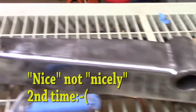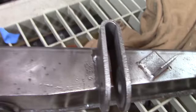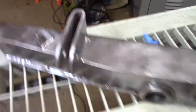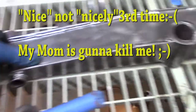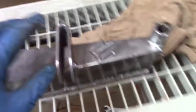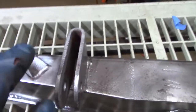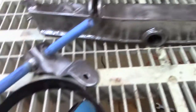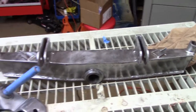That cleaned up rather nicely. I still have to figure out how to get down into some of the recesses here, but for the most part this cleaned up really, really nicely. So what I'll do is get some phosphoric acid on there, and after I figure out how to get this stuff out and clean just a little bit more in there, get some phosphoric acid on it and it'll be ready for painting in the spring.